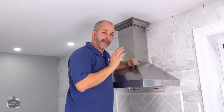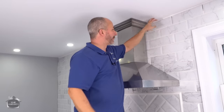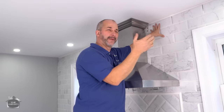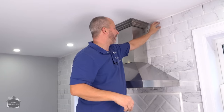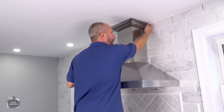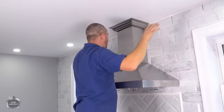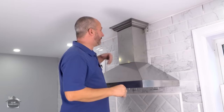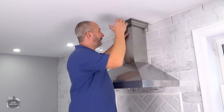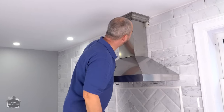Interesting. Now, I know it looks a little ugly up there. The reality is my house is bowed. The last course of tile, I installed it because I wanted to see how ugly it was and talk about options. We decided we're gonna pull this off. We're gonna be putting a 3/8 inch piece of good one side plywood all the way across, and then we're gonna add a new crown molding to both sides of the room to balance the look. It's the only way we can do it. So what I'm gonna do is take this off for now, get all that installed, and then we're gonna reinstate this later.